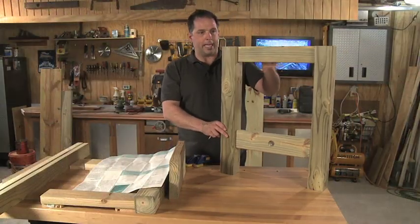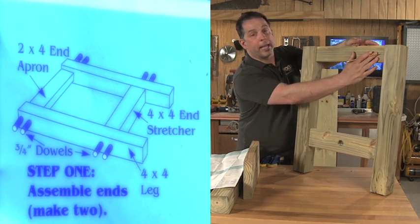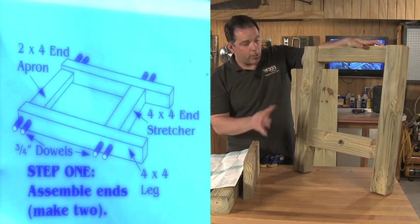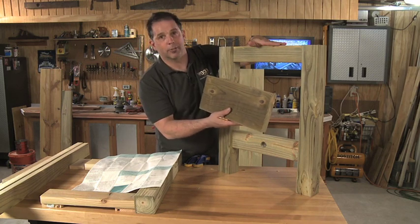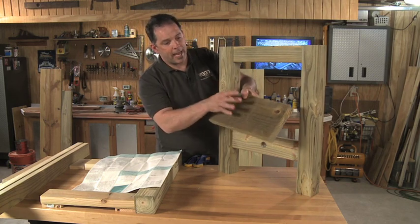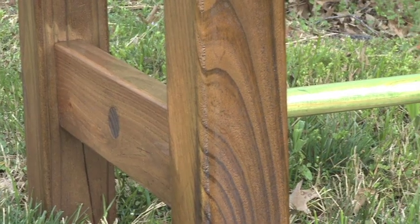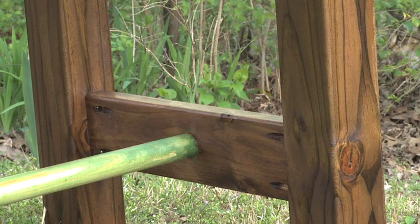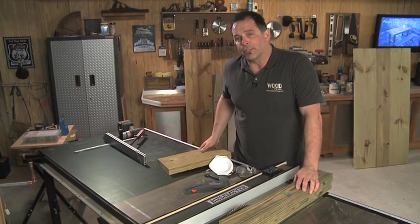Let's start by talking about the leg units. The plans called for a 2x4 here up on the apron and a 4x4 stretcher down here near the bottom. Instead of going with a 4x4, I actually took a scrap piece of 2x8, cut reasonably close to a 2x4 out of the top here, and then whatever was left, I used for the stretcher along the bottom. I also did a lot of re-sawing on the rest of the parts, which really makes the grain stand out, and it's a great way to reuse some of your scraps. It's really nothing more than just changing the dimensionality of the wood.